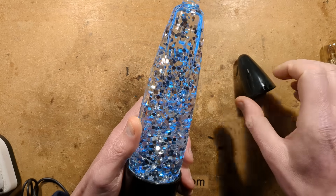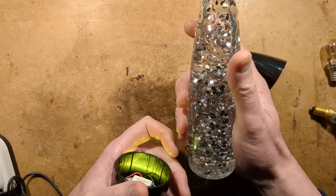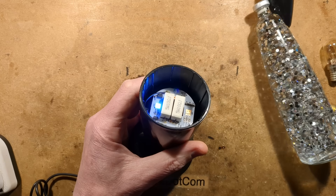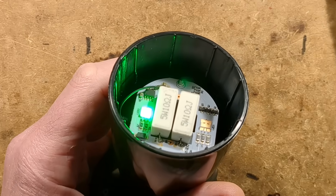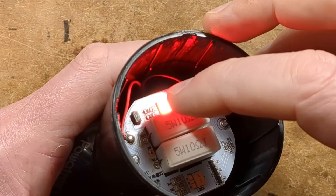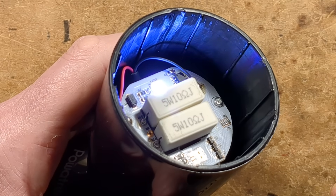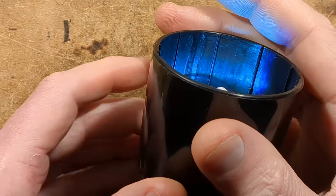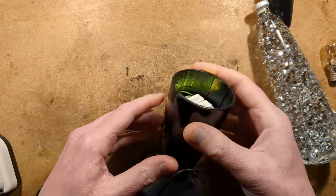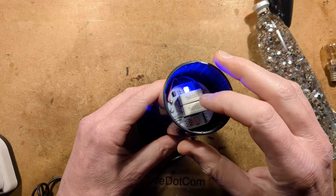Let's take a closer look. It starts off as a standard glitter vial with liquid — they actually tell you what's in it, which is nice. The circuit board inside has a single colour-changing LED with a microcontroller and a couple of resistors that are very hot. The power consumption at 5 volts is about 900 milliamps. There are two 10-ohm resistors in parallel, which gives 5 ohms.